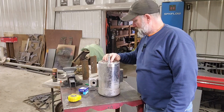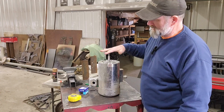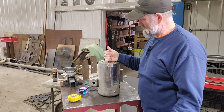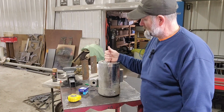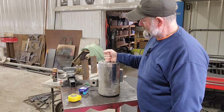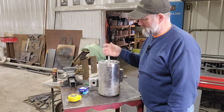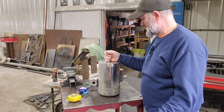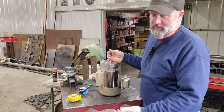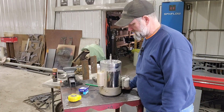But the story is that the seal went bad on the pump itself, which would be kind of right in this area, and it was blasting water right into the motor, which in some cases wouldn't be that bad, but the cleaning solutions, there's chlorines and acids and everything, so anything with iron in it is pretty well toast. And it probably cooked the grease right out of the bearings. So I'm hoping that's all that's wrong, is that maybe the bearings are bad. It's thermally protected, so that usually saves the motor if it's not really too bad.